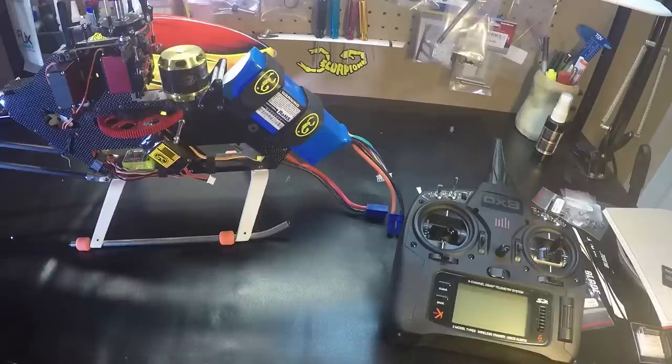It's used in case of an emergency — if you have a bad solder connection, a brownout, or you lose power. It will power up your receiver, your flybarless system, and your servos so you can land safely. It will not power up the motor, but you will still have control of your helicopter.